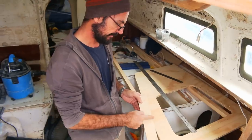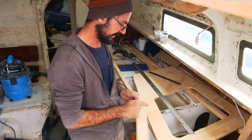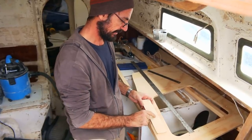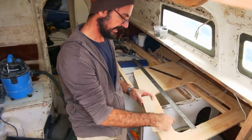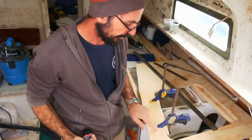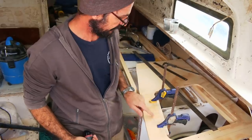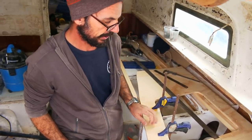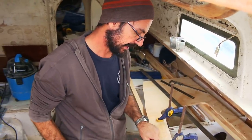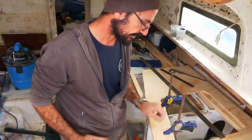Now that I've got those layout lines, all I have to do is match up the middle line — which is the middle of this piece — with the middle of that gap. I know that if that line is matched with that edge, then this line will be in the middle. I'm pre-drilling all of these now because later on when I assemble it, I'll be giving everything a smear with epoxy glue, and then screwing it together with some 8-gauge, 3-and-a-quarter screws. This bit, even though it's getting a bit blunt, as it drills it counter-sinks ready for screws.